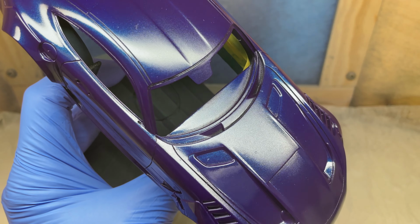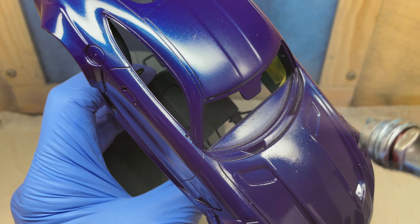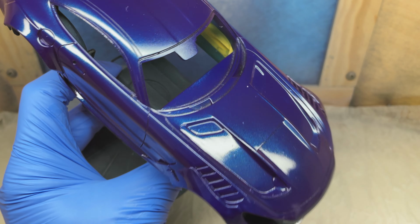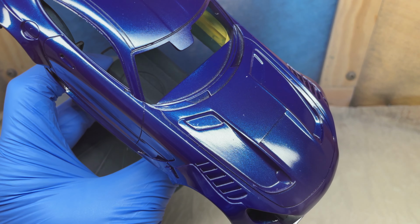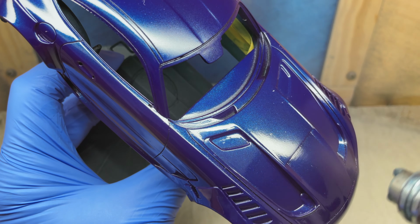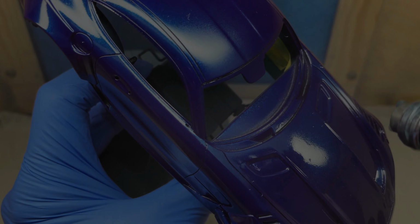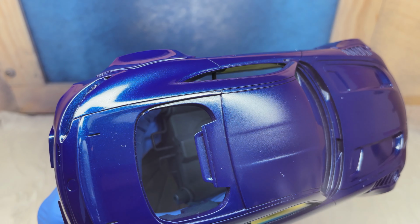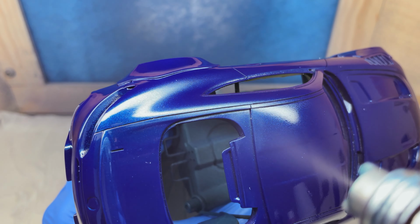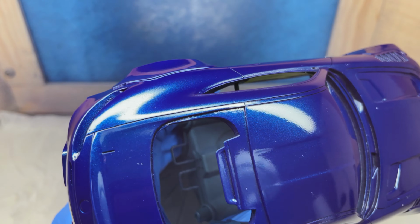These third, fourth, fifth, sixth coats should give an equal finish, an equal look, an equal surface. Just a reminder: if you see orange peel, you need to add more thinner or more layers. Don't leave it at that level, and monitor whether the orange peel is disappearing. If not, then you will need to spend more time on sanding, just wasting a lot of time and energy. It's better if you monitor the thinning ratio and the temperature.